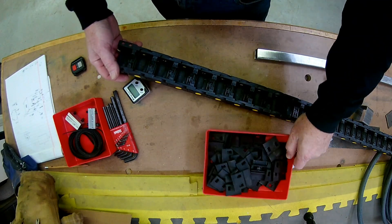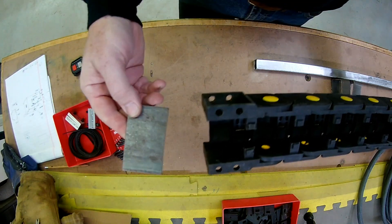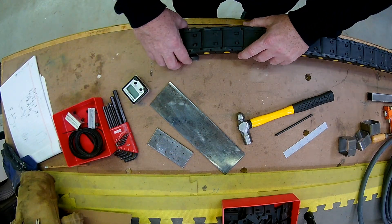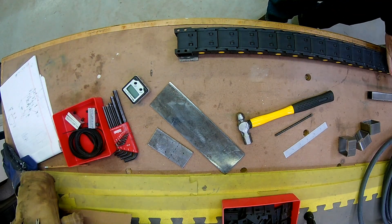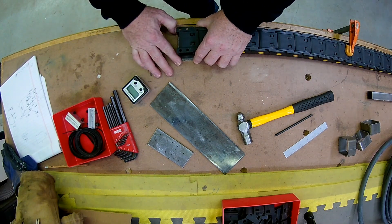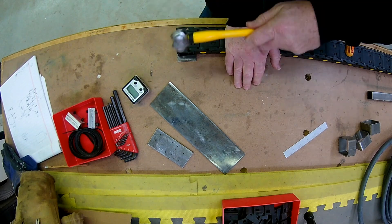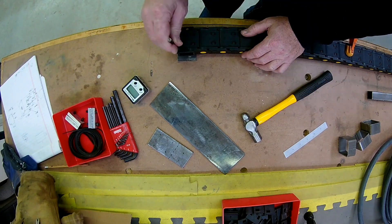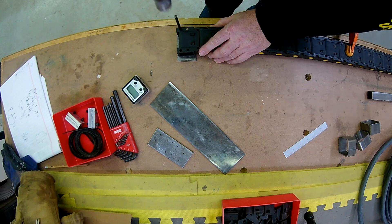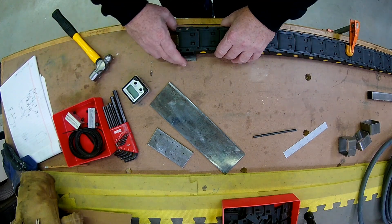These are the little clips — I've got them all pulled off and set aside. At each end of the cable track are pieces with four holes to bolt down. I've cut a series of pieces of small plate that are going to be the right size for where it's going to get welded to the frame. I'm going to start by using a transfer punch and drilling and tapping holes here on the bench. The track doesn't like to lay perfectly flat by itself, but clamping it to the bench holds it down tight to the piece of metal I'm marking. The transfer punch just goes through the holes — give it a quick whack and it leaves a mark in the center. If you haven't seen these before, they're super handy for this exact purpose.